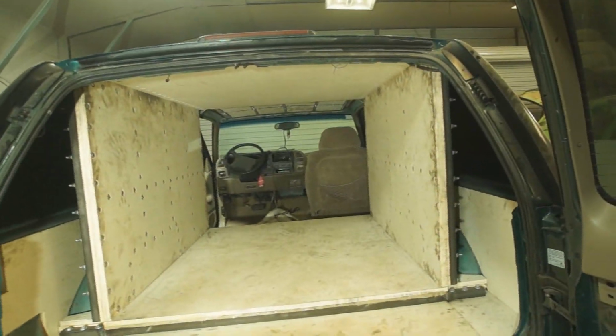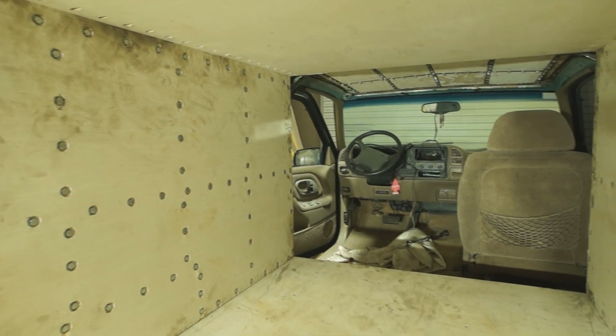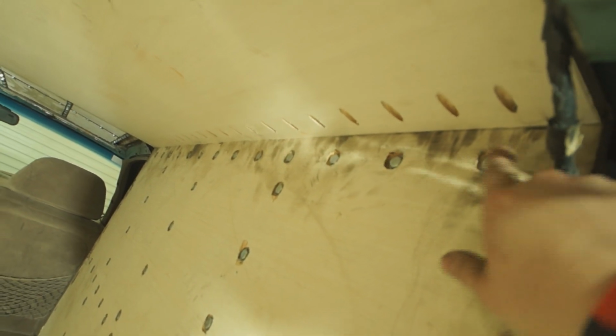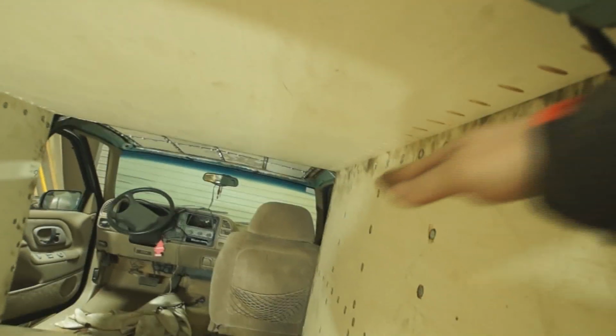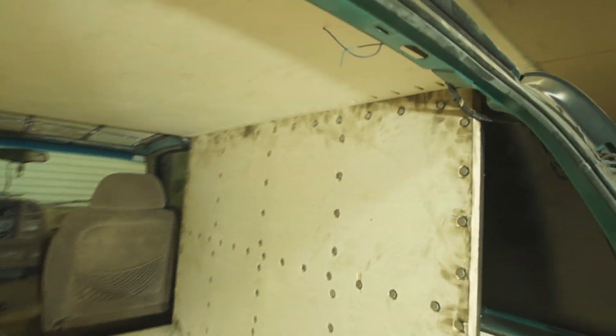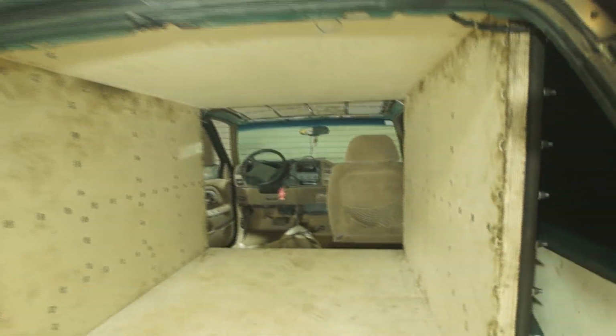But with this right here, the shell, it's been a task. It's been a lot of time consuming work, especially with these side pieces, welding these all together, as you can see probably with this video that I just made. I know I went up here and made my 3/4 inch mark, since it's only one layer, and went across so that I know that these pieces are perfectly straight with the sides of the top, which they are. Definitely got every bit of the height out of it I wanted. I had to grind a little more, but it definitely worked out.